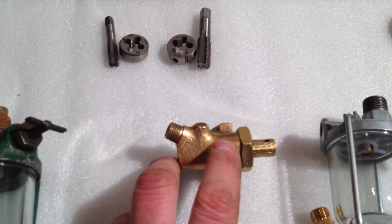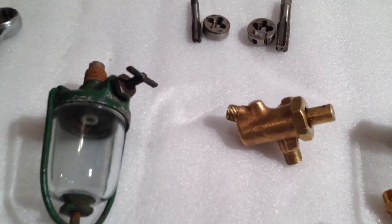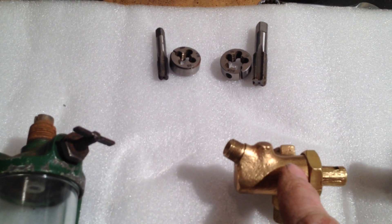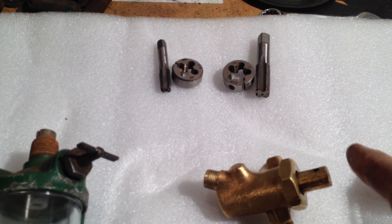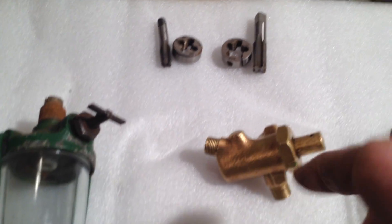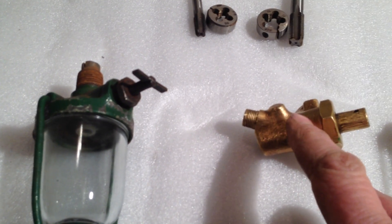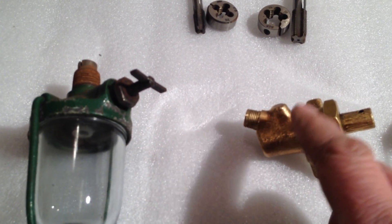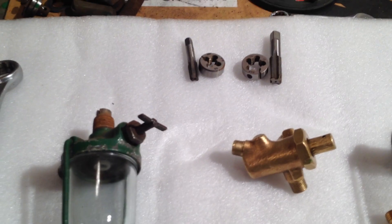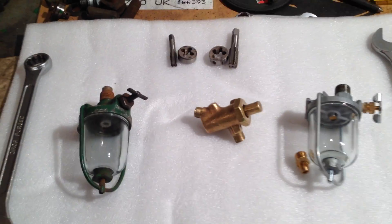I have a tip for making these three-way valves seal a little bit better. I would say it works about 50% of the time depending on how worn it is inside. What I do is get a little bit of the finest valve grinding paste and put a little around the tapered end of the shaft, then put the two pieces together and gently grind it by screwing it backwards and forwards. It just smooths everything out again inside the body, both on the taper and on the body face. As I say, it works about 50% of the time — not brilliant, but it does work to some extent.